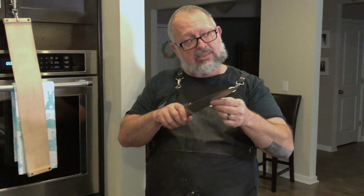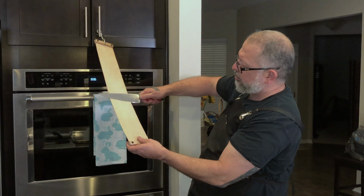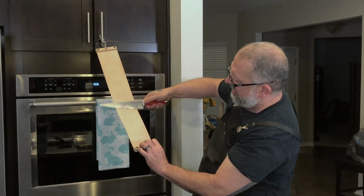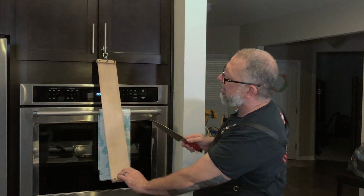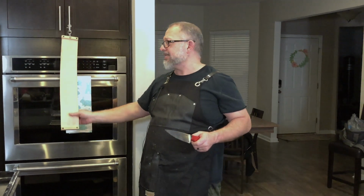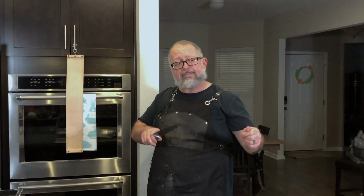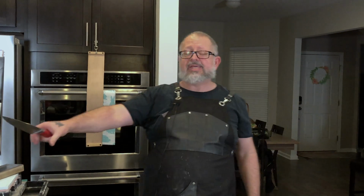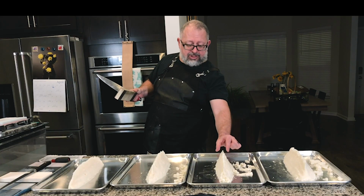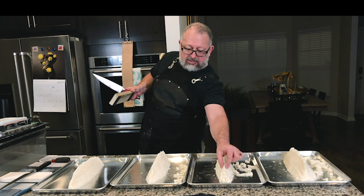Now, you're still going to have a little toothiness that we'll talk about, and you have a rough side and a slick side. You can do the rough, and then you can do the slick. But then you're going to want to go to, and by the way, I didn't mention, this has no diamond emulsion on it. The hair on it is coarse enough and the leather is tough enough that it's going to go ahead and rip that wire edge off at the base. Then we need to polish that toothy edge that we showed on here, to make that a little bit cleaner.